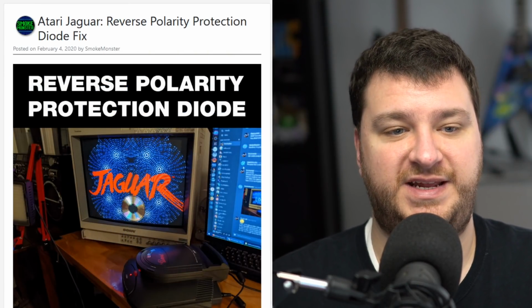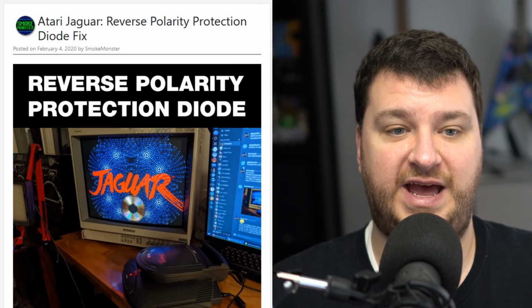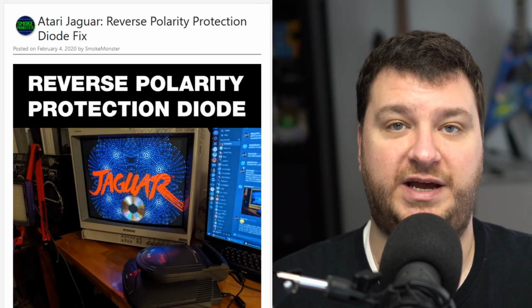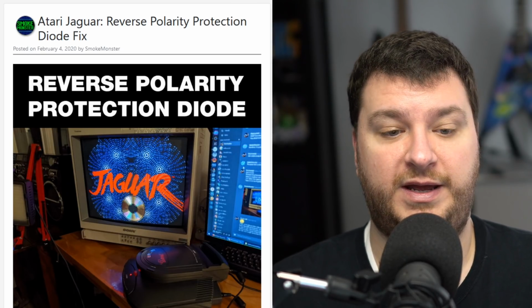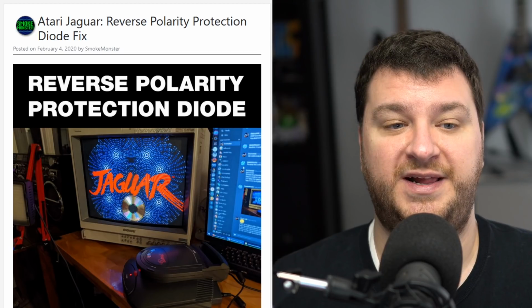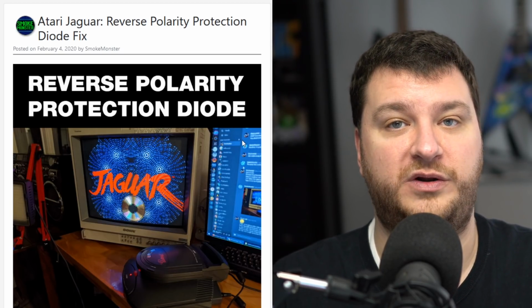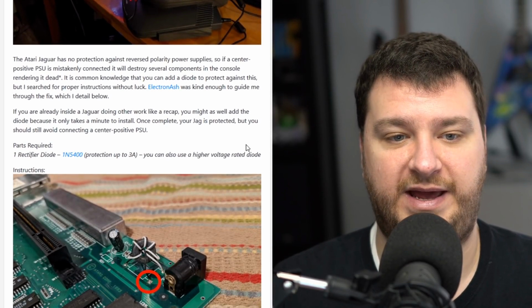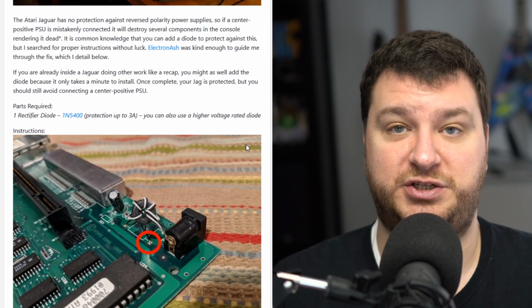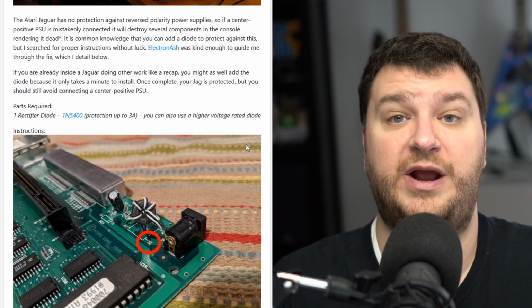Smoke Monster just posted a safety-related article about the Atari Jaguar that involves adding a reverse polarity protection diode to prevent it from blowing out. Now, if you use an original Jaguar power supply or one that's fully compatible, that doesn't matter at all, and this doesn't apply to you. However, what if you accidentally plug the wrong one in someday? If you do, you'll actually blow out a component on your Jaguar, and it will require a repair to it.